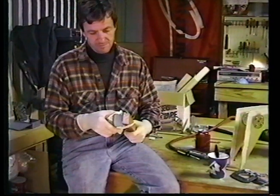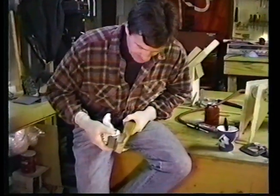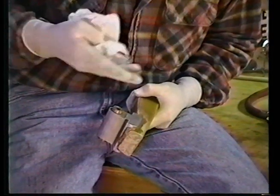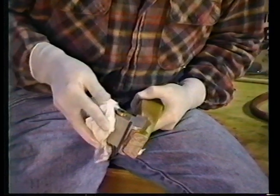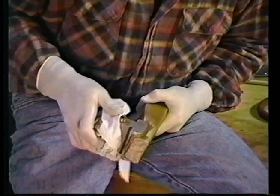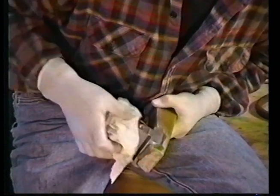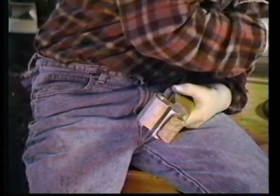All right, here we go. I got enough flox in there to squish out in all directions. It's coming out the sides. It's coming out the top. I'm a little below where I want to actually be, so I make sure I have room for everything to squeeze out, which will ensure resin, flox, and no air between all mating parts. After I've got it pretty much squished in place this way, I do a quick swipe. You need to go into the flox now.